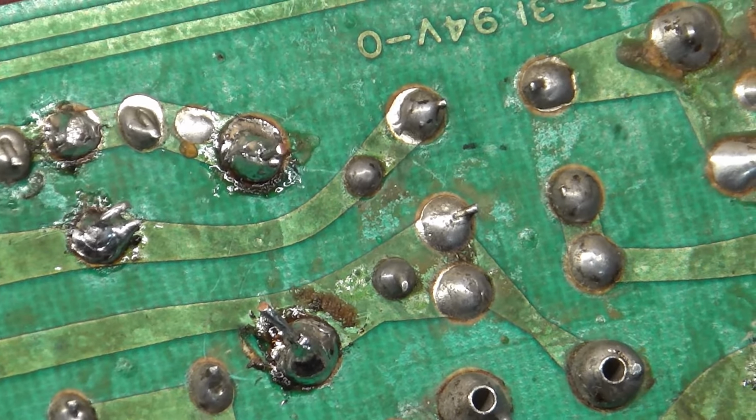It's not a spike lead joint, it's just a regular solder joint. But you can see here, if I pull on the resistor, R89 is completely out of circuit on both ends. We got a broken pad and a completely broken joint there. It's just coming right out. So we'll have to fix that. As a matter of fact, I'm just going to take this out real quick. Again, par for the course on all this stuff. Yeah, look at that.